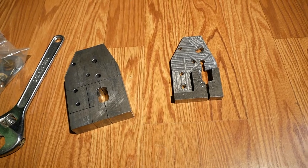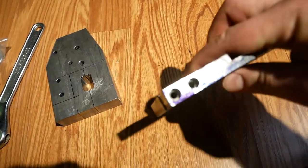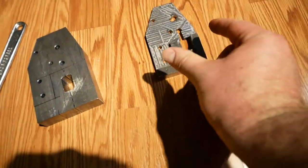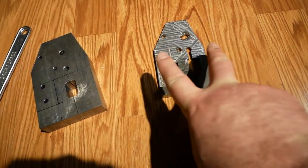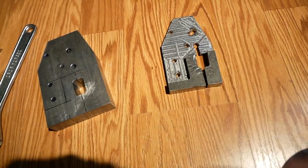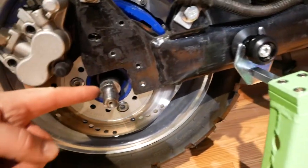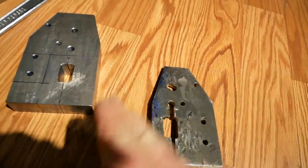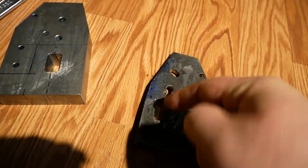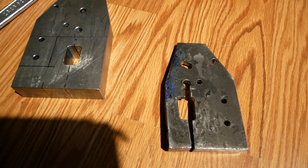So then I made version 3, which clamps. This is half-inch thick HRO — hot rolled steel — with two M5 screws in the bottom to clamp it together. I figured these were going to work perfectly and forever, and they didn't. As you can see, this is kind of V-shaped — both sides are stretched. When the tire is spinning and you're driving down the road, all the motor torque acts right here, and this wall right here is more of a curve than straight, and those sides are now a V rather than parallel. Hot rolled steel is simply too malleable, too bendable, not tough enough.